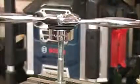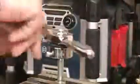The die will start to show some resistance when it encounters the damaged threads. At that point, you want to start turning the die forward about 1/2 to 3/4 of a turn, then back it up about 1/2 a turn to break the chips, and keep repeating that cycle. Even though this is light cutting, I still add a little bit of oil just to make sure everything goes smoothly. Then after we've cut through the damaged threads, I'll go ahead and run the die up and down the bolt a couple of times just to make sure it's cleaned everything up well.